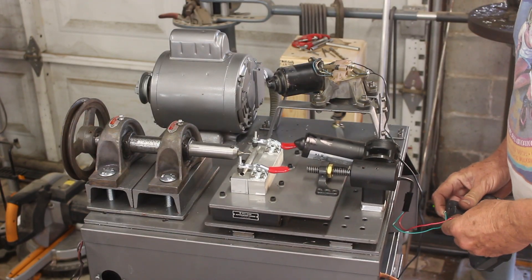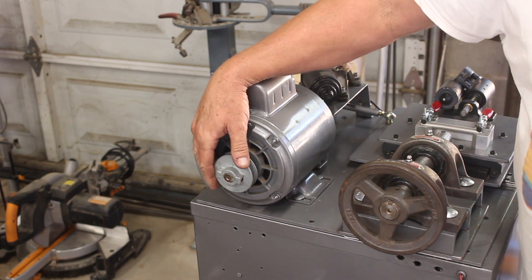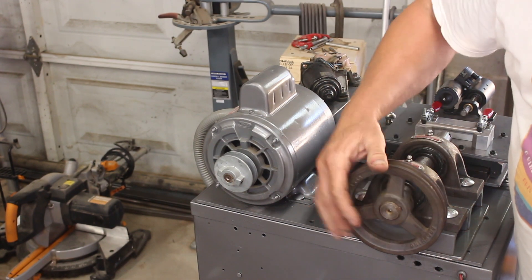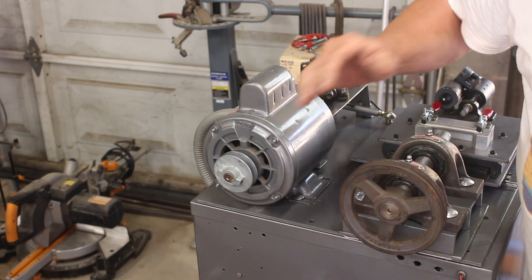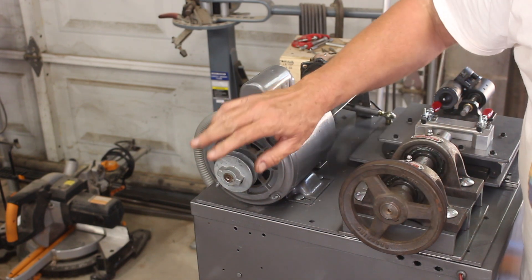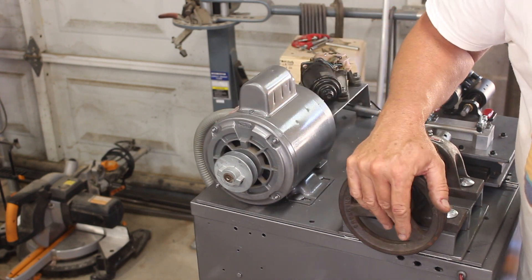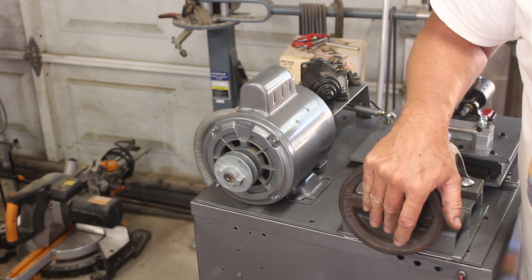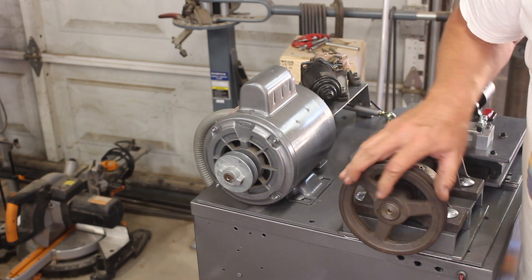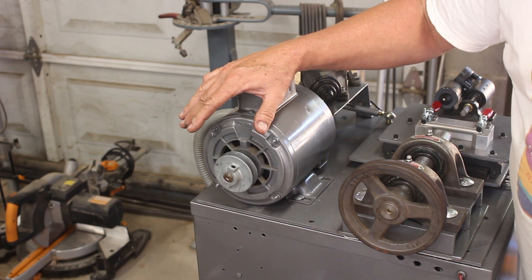We've got x-axis and y-axis motion, but we don't have drive to the spindle. We have 1750 RPM with a two-and-a-quarter inch pulley on the motor and a five-and-a-quarter inch pulley on the spindle. I did the math thinking the spindle would be spinning around 4000 RPM — except I did the math backwards. The big pulley needs to be on the motor to get that result. The way this is set up only gives me 750 RPM on the spindle, and that is nowhere near fast enough. It needs to be up around 4000 RPM, so I've ordered a 12 inch pulley for the motor. Just when I was making great progress, I get stopped by a rookie mistake like that.